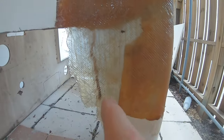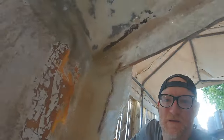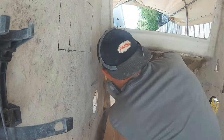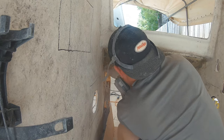Here's a close-up view after the resin has tacked off. I left a little bit extra, and on the back side it was probably about six layers on the inside. Then I'm going to use my cutoff tool to make that corner rounded again.